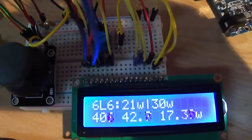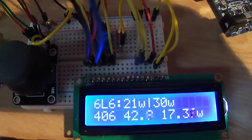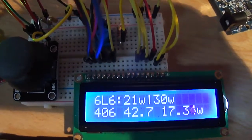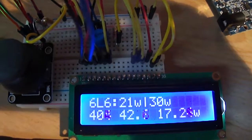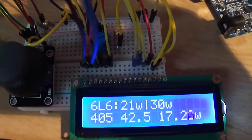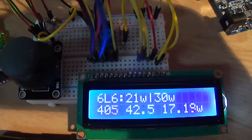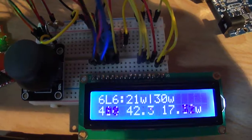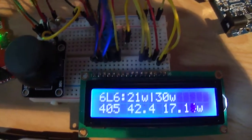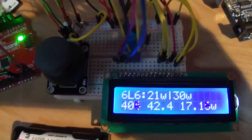We're running a little bit cold. We're at 406 volts, 42.78 milliamps of current. So that equates to 406 times the number of milliamps gives us the wattage, which is 17.2. That's great. Running a Twin Reverb a little bit cold is fine, and it'll sound great. It's right near the target for the bias. I could turn it up a little bit hotter, but it's probably not necessary.